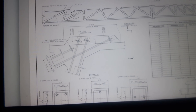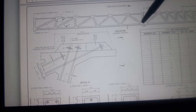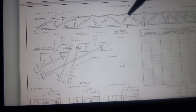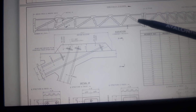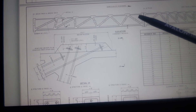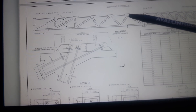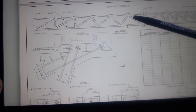Member 12 is like an upright — it's got its own dead weight forces. What is theorized: number 11 is getting post-tensioning on it at this time. After so much force was created by the hydraulic tensioning tool, the crown started evening out. It created so much pressure — like the glass theory — the cable had so much force on it, like an upside-down glass bowl: you put all the pressure on it and then when it reaches its max, it just shatters. You won't see it coming. They started loading it.